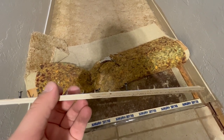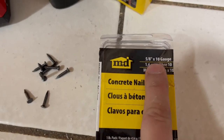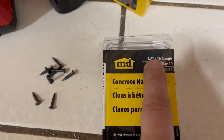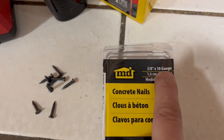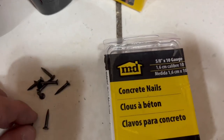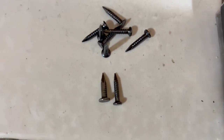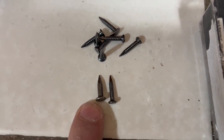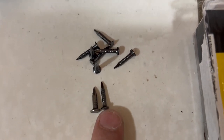Also, maybe some shorter ones will help. These are the only nails that were available at the big box store that you can purchase for cement — next to the tack strip. They're 5/8 by 10 gauge, so that's the thickness and that's the length. And as you can see, these are significantly more robust and less prone to bending.